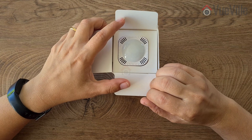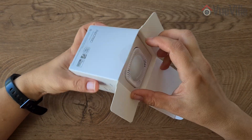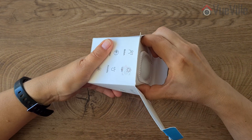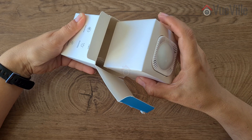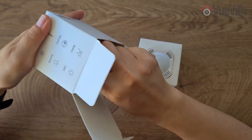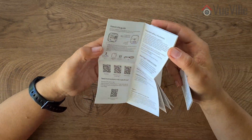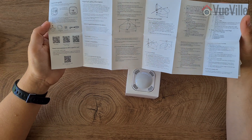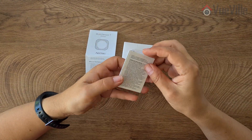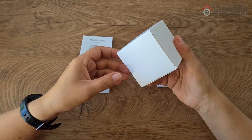In spite of the 7 in its name, the Multi-Sensor 7 has six sensors, just like its predecessor: motion, vibration, temperature, humidity, light levels, and ultraviolet index. Where the Multi-Sensor 7 improves upon the 6 is in the 700 Series Z-Wave support and better sensor sensitivity. For example, the motion sensor now has a stated range of 10 meters or 32 feet, versus 5 meters or 16 feet earlier.